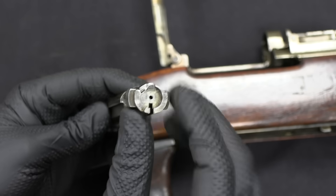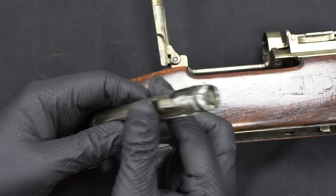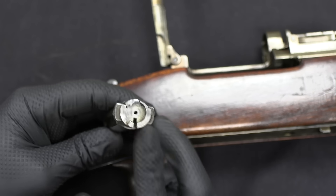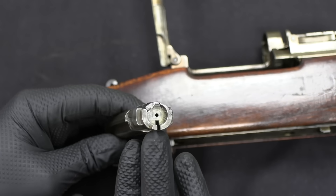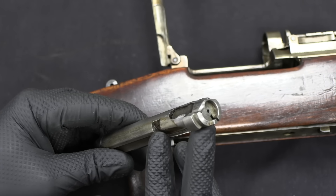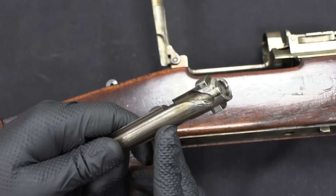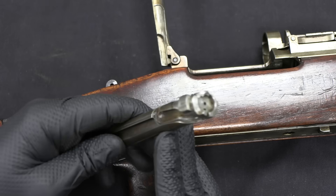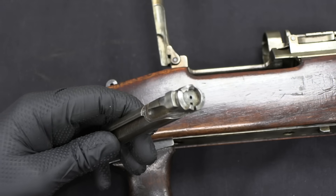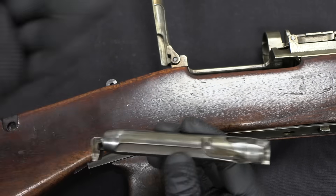There's an ejector cutout right there in the bottom. You may notice that this is a little small for .303 British — this is in fact chambered for 7.92mm Mauser, which seems a little bit odd for the UK during World War Two. But it's worth noting that all of their semi-auto rifle development was going on in 8mm. The Besa light machine gun and Besa tank machine gun were in production, in use by the British military chambered for 8mm Mauser. I suspect this was just the natural choice because the ammo was in use, and there was a significant possibility that the British military would go to either 8mm or .30-06 as a temporary interim cartridge in the years after the war. They could design guns for one of these existing rimless cartridges and then easily convert them to whatever rimless cartridge of their own design they ended up choosing. So that's why this is in 8mm Mauser.